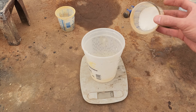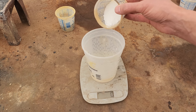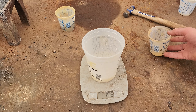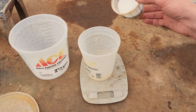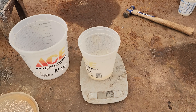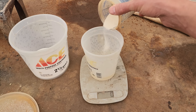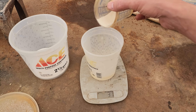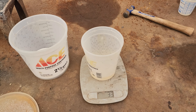I've been having real good luck lately mixing one part concentrates, one part anhydrous borax — so this is our anhydrous borax — another part of soda ash. Then you add in somewhere between 20 and 40 grams of silica sand. It didn't look like that stuff had a whole lot of silica in it, so we're going to shoot for about 30 grams, somewhere in there.